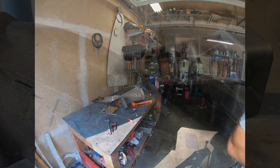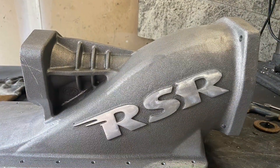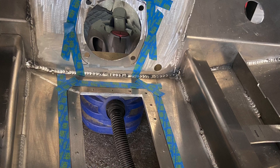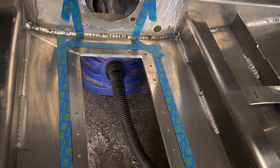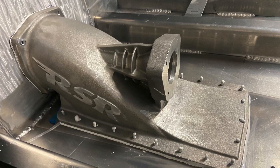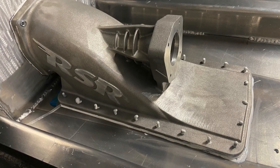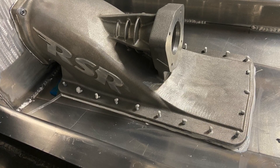There's a raised part of the mold in the pump that was all dull, so I just hit it with a little 3M disc pad to brighten it up — I like the way that turned out. Then placing it in the bottom of the boat, marking it out, taping it off so you don't make a mess. I used marine adhesive 5200 — it comes in two types, a long cure taking seven days to fully set up, and a short cure taking about six to seven hours. The pump is now installed — removed the tape for a nice clean job. 5200 gets everywhere but it's an amazing product. The pump is in, the boat's ready to flip over, do that butt weld for the 3/8 to 3/16, and we'll show that next time.